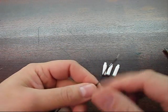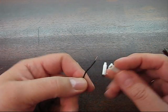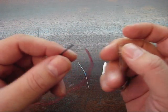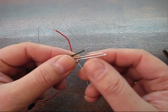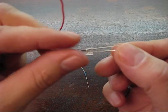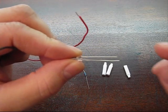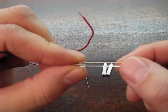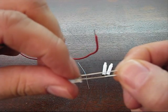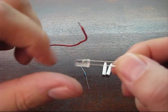You get the black lead. You can strip this off a little bit more if you want, but these crimp connectors are actually meant to even bite onto non-stripped conductors, so I'm not gonna bother for this. LEDs are polarity sensitive — there's always a short lead and a longer lead. There's also on the short lead a little flat spot on the side, and the short lead and the flat spot indicate the cathode, which is negative.